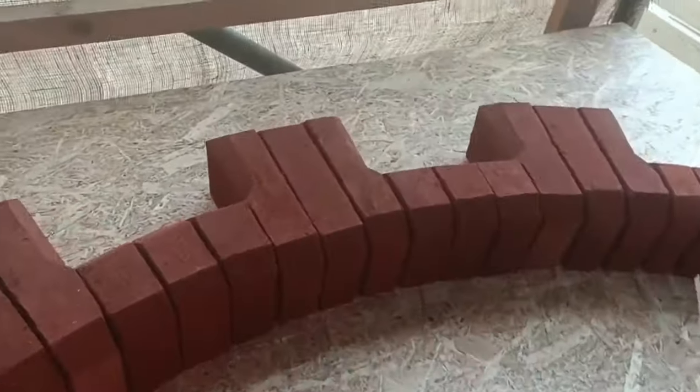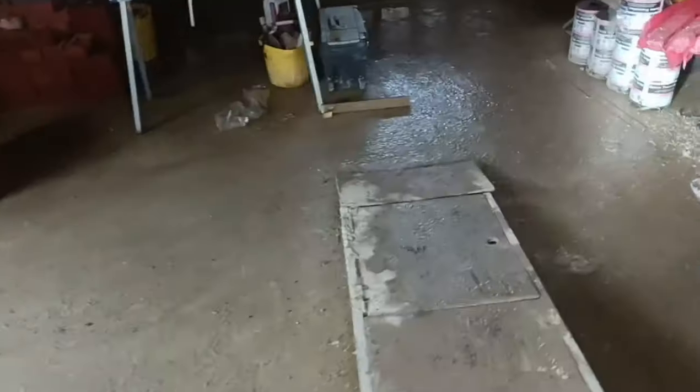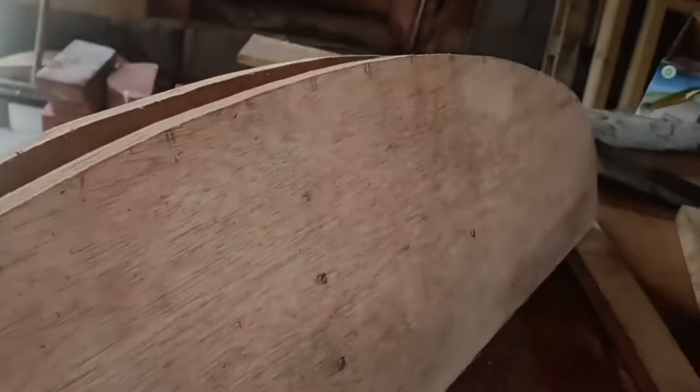The arch is all cut and ready for the arch centre to go in. Just a little recap on the arch centre - it was all drawn out here and then we find the striking points, radiate for our joints, and when we draw these on I extend all these lines so that when extended I can draw them all onto the arch centre, so I've got something to follow. With them being on there they match these ones identically, and you saw how when I was cutting them I was just laying them in to make sure that each time I came up to these joints and marks I left myself a bit of a joint. So I'm now going to take this over.